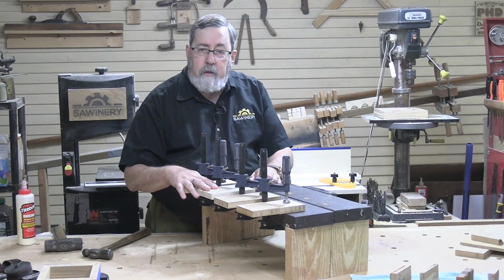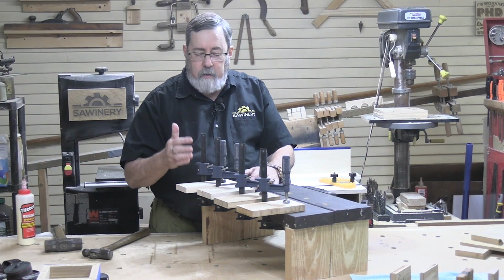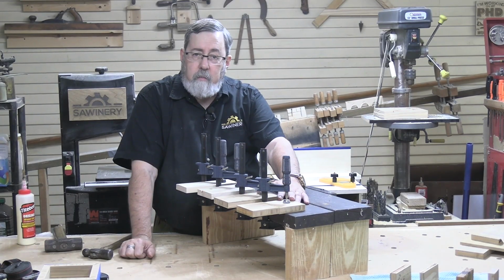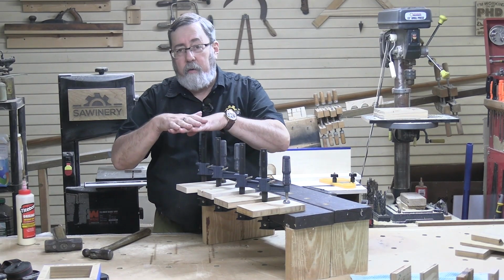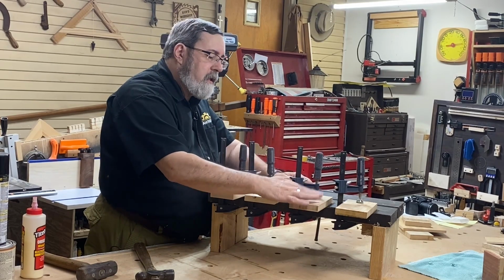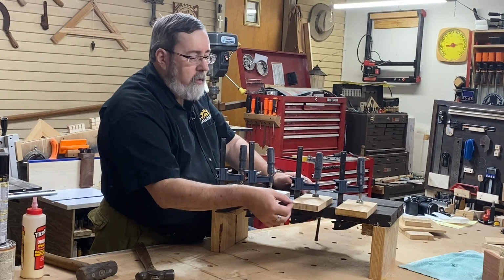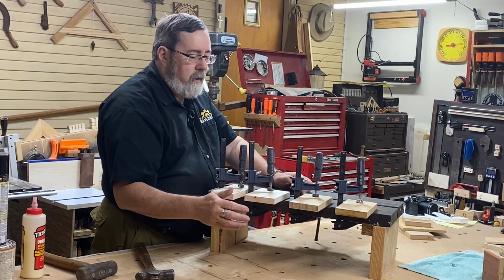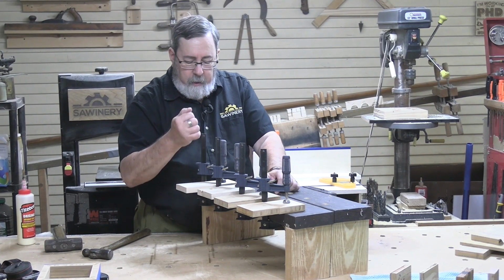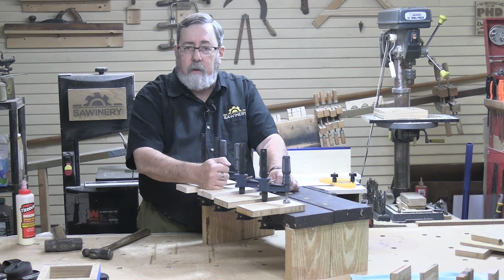I've done end grain and long grain, okay? Now, I've done these tests before between end grain and long grain in pine to see how strong it was. I've added my bamboo plywood, and of course, being plywood, I've got grain going both directions, right? So this piece is predominantly long grain, and this piece is predominantly end grain, because our core is a rather large core, and that's really what we're looking at, okay? Probably the first one to fail, unless the bamboo does, will be the long grain pine, because the pine itself will break long before the glue will.